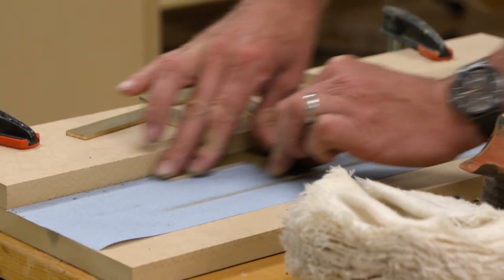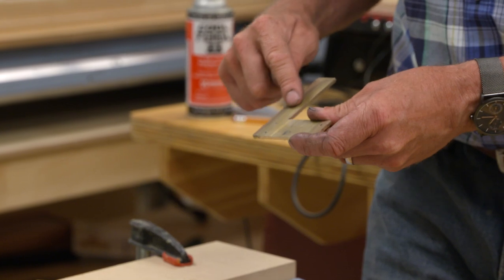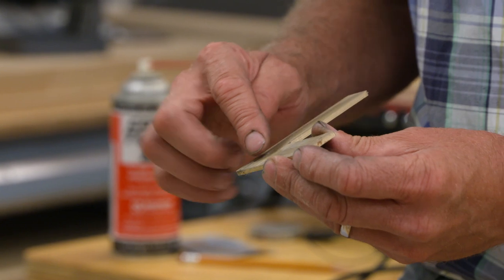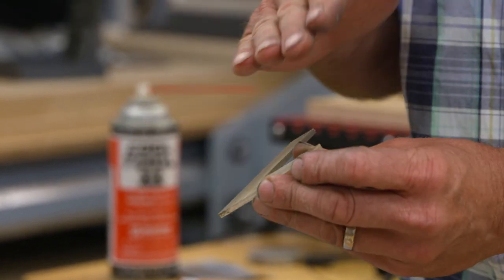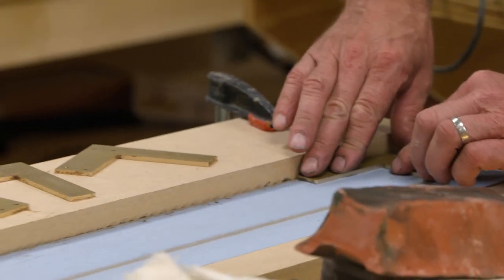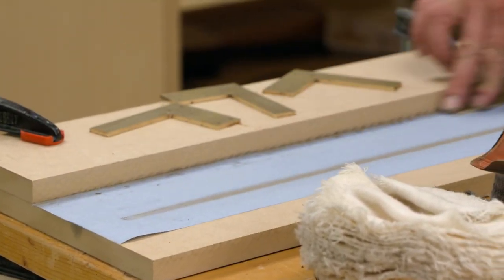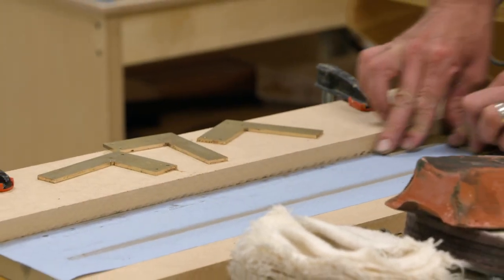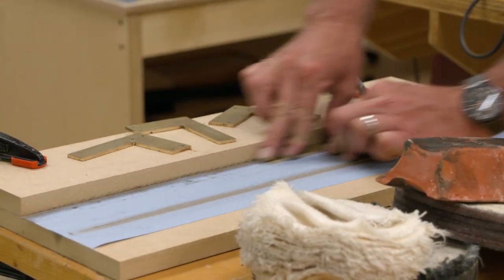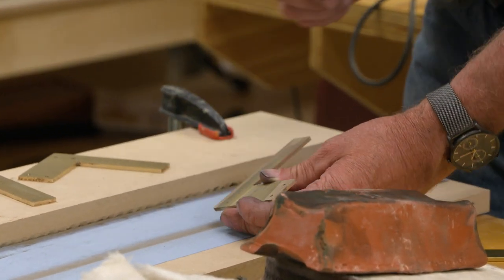Back and forth, holding things in line. And little by little we'll start to remove some of the oxidized area and reveal nice, clean brass. I've got a little ways to go because I'm hitting the outside first, so there may be a slight bow to this brass — I can flatten that out. You can stop at any point with a grit, or you can continue down to a very fine grit. I have 220 paper on this board now; I could keep going to 1200 and it would start to approach a nice polish.